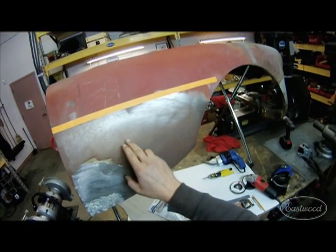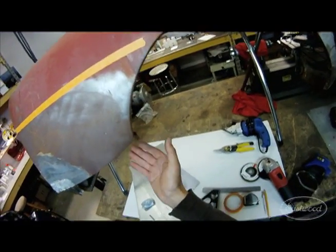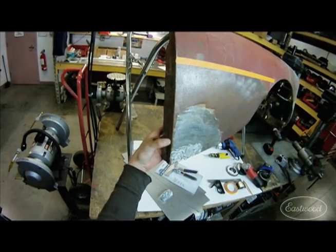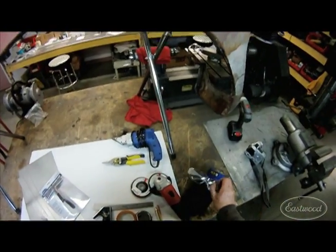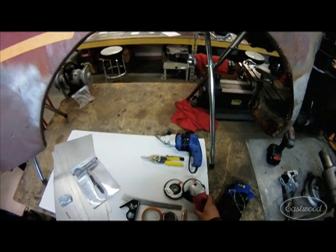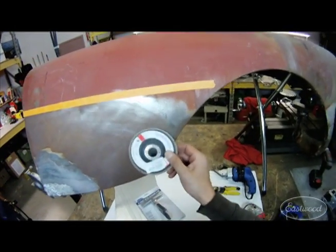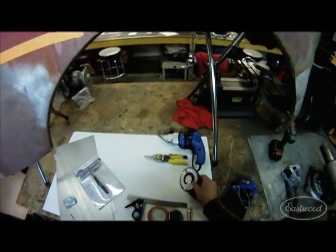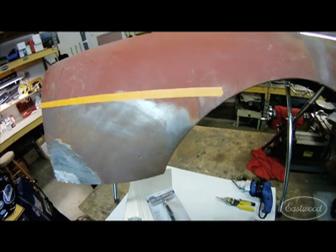There's a compound curve, a 90-degree bend, another 90-degree coming back here, and a 90-degree vent bend with maybe five or six spot welds. What you need to do this: MIG welder, safety glasses, gloves — always when working with sheet metal — a four-inch grinder, and pick up some flap discs. These are great for weld prep and will remove surface rust, then for weld blending. They run cool so you're not warping metal.